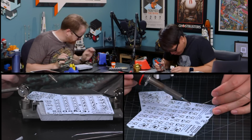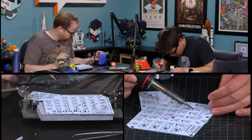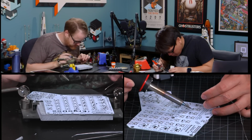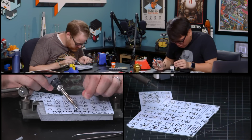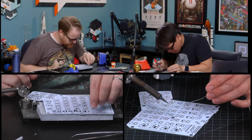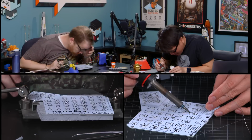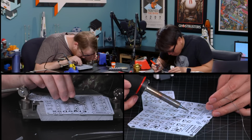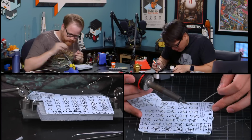The hard part for me is going to be seeing the, what do you call it? The letters. The lines on the thing. Oh, there's one I missed. So you definitely don't want the solder touching the actual diode? I think it's fine if the solder touches the diode a little bit. I mean, ideally you wouldn't, but... Yeah, it's so small. Okay. We're putting the tiniest amount. Yeah, the problem I have is that seeing the actual line is pretty tough. Wow. Yeah, it is really the tiniest amount.